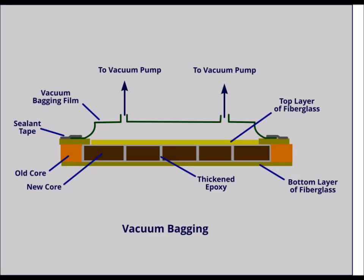The best method of all is to use a vacuum bagging technique. A plastic sheet is taped into place around the area and a vacuum is created under the plastic using a vacuum pump. Since atmospheric pressure is about 15 pounds per square inch, an area of just one square foot can conceivably have almost a ton of weight applied evenly over the entire bonded area. In practice the amount of pressure would be less than this, but it would be significantly more than the other options. It does require more equipment and manpower than I have, however, so I can't vacuum bag this job. Instead I plan to use the wood strips screwed into place.